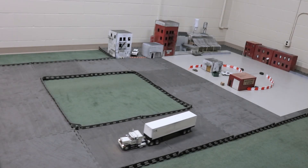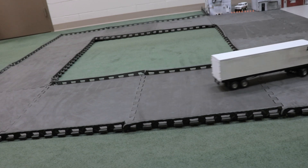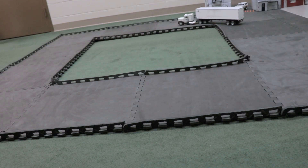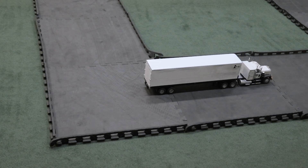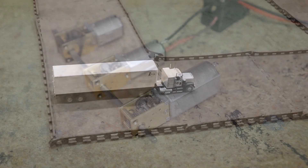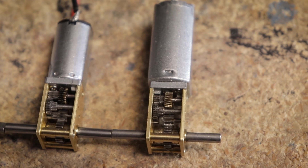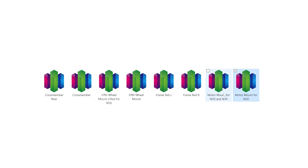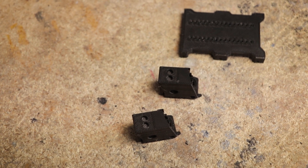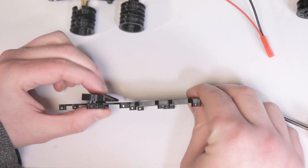Now, if you really want to pull some styrene with ease, the N50 seems to be the way to go — more power and an even higher top speed. This is really more to the level that I wanted when I started this project. Nothing crazy, but it's got decent enough low-down modulation, reasonable top speed even with the trailer, and plenty of power to go up reasonably steep inclines and tackle some bumps. While the gear assembly remains basically identical on all three sizes, the N50 motor is not just longer, but also wider and taller as well, meaning it needs its own unique motor mount. When you're selecting the STL files you want to print, you can choose either the current N20 and N30 motor mounts or the new N50 mount.